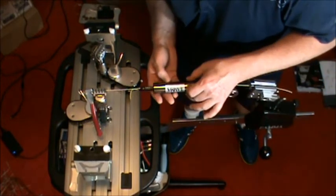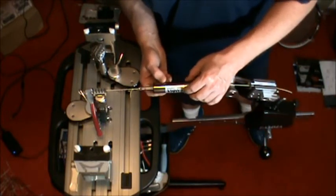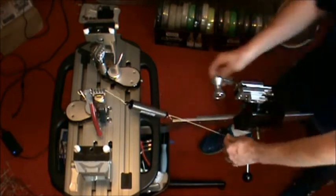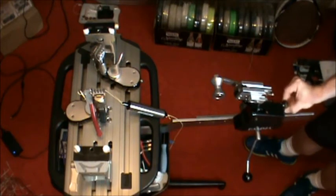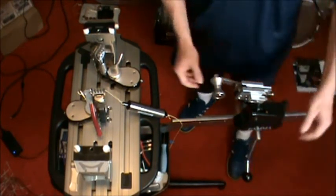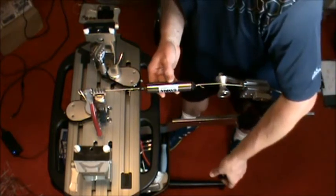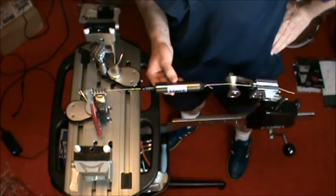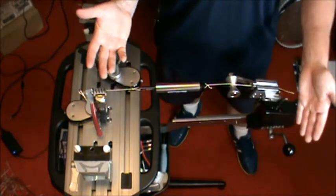And perfect. So maybe if it's not too much trouble, I might zoom in the camera here so that you can see the readings here. But let me check 60. So that's exactly 60 pounds over here on the machine. Let's see if we're pulling 60 pounds. And I can just see the white line, the hash mark there at 60 pounds. So that's how you calibrate a Gamma, lockout, or crank machine.